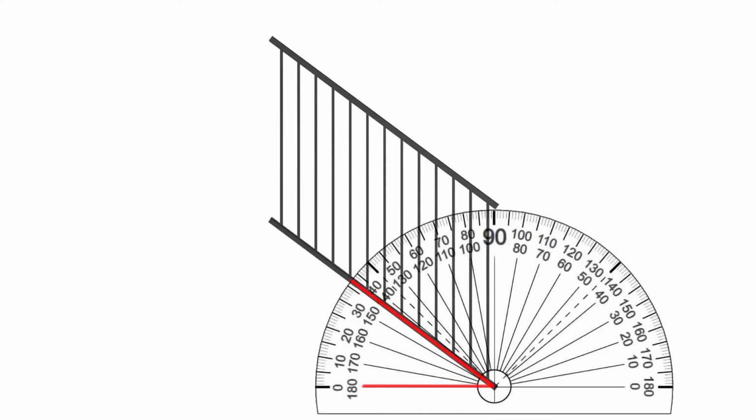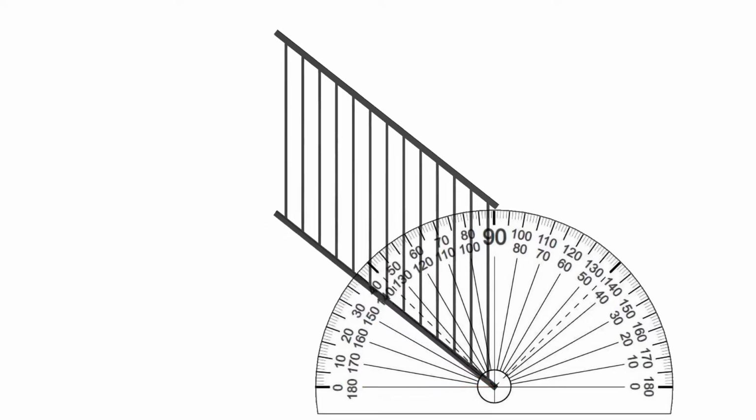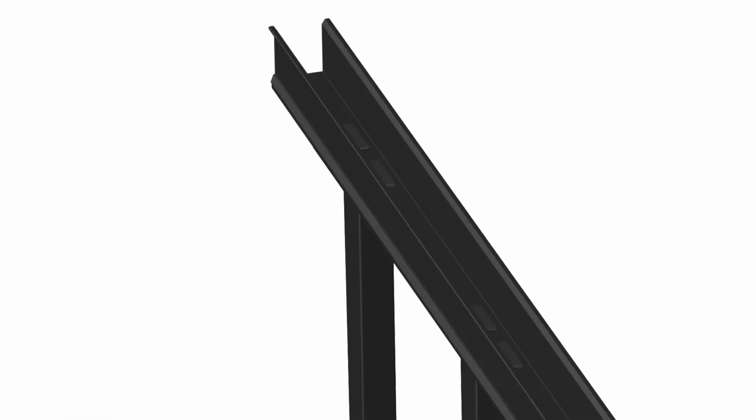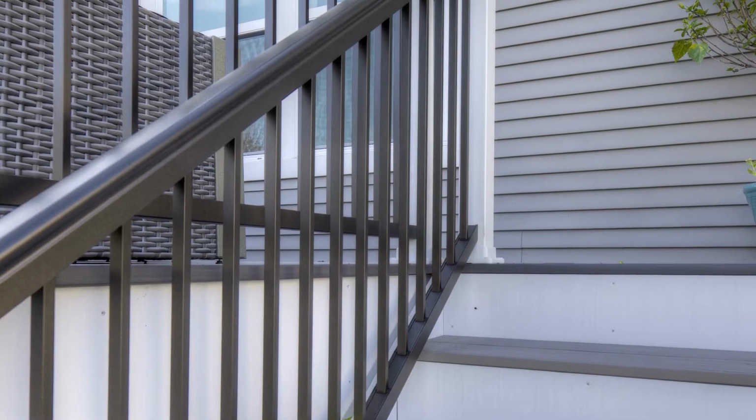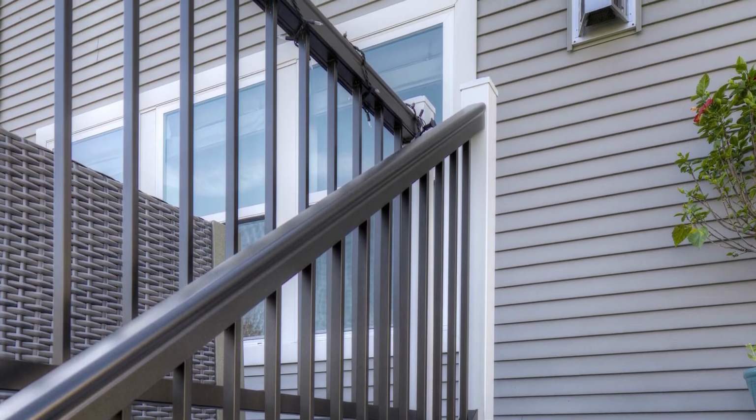Stair balustrades are shipped at a 37-degree angle. Balustrades are adjustable and will accommodate 30 to 40 degree stair angles. When setting your angle for your stairs, only crank your panel once. Continual adjustment of the angle back and forth will cause the pickets to become loose and rattle. You can use a nail punch to gently knock the tabs back down if this happens, but avoiding this by limiting the angle adjustment is recommended. Using 2 posts at the top of the stairs is recommended if a compound angle cut is required.